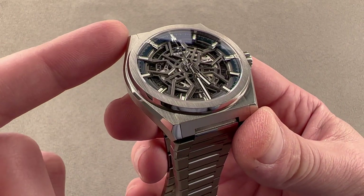The dial is handsomely executed. Unlike many skeletons, it's not hard to read, and due to the presence of the movement below the dial, you don't see your wrist hair through the dial. You can see there's a cantilever to the indices, and the center features a nickel anthracite coating with polished beveling on the edges of the central components that splay out like an automobile wheel's spokes, with satination across the tops of the spokes. You can see visible motion works where the adjustment of the hands actually takes place, a view into the clutch mechanism and keyless works. Note that this watch includes both hacking stop seconds and a bi-directional quickset.